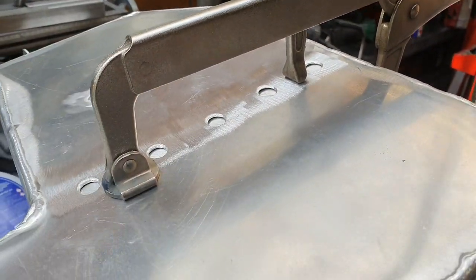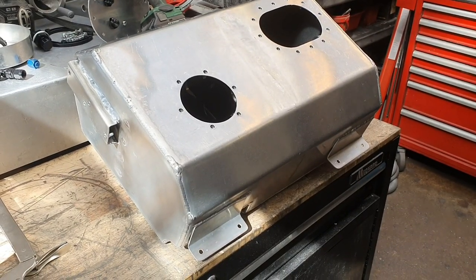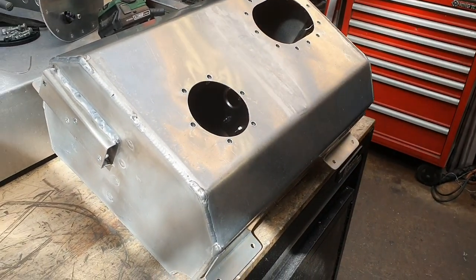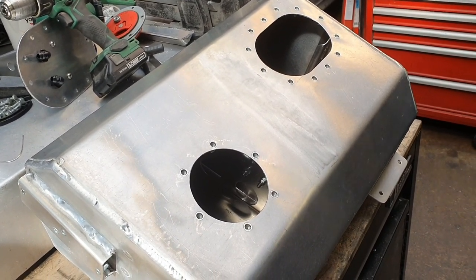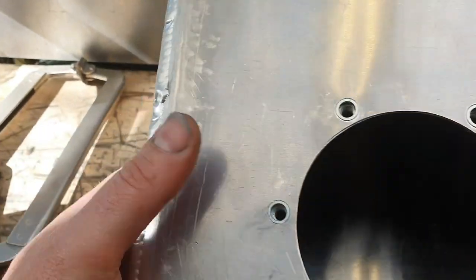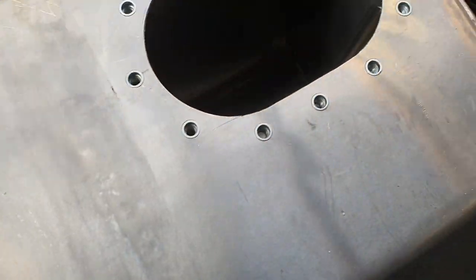I'll weld those in and have to test it again unfortunately. Had a late lunch. I didn't really pass the test as well as I would have liked, so I need to add one or two more things. We've got the little brackets here — I even put lightning holes in it, got a bit carried away perhaps. There's a stiffener on the side there just to keep that in check. It had moved out maybe three to five millimeters max — it looked like a lot but it wasn't heaps. Another one on the other side.